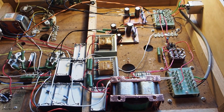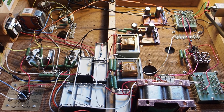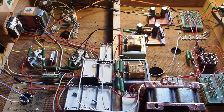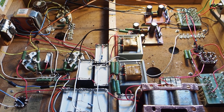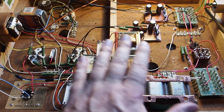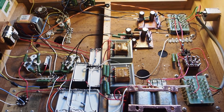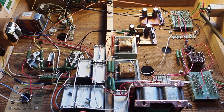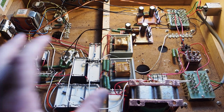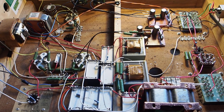These two drivers are already quite different. So how about we create two channels — one for the lows, one for the highs — so that I can tune the sound character to better suit the two drivers given their differences. So this is not about losing coherency, which is a big pitfall of going multi-channel because it becomes much harder to make it a consistent, coherent performer across the spectrum. But I hope to tweak the tubes and the design so that it will actually bring more harmony rather than less.